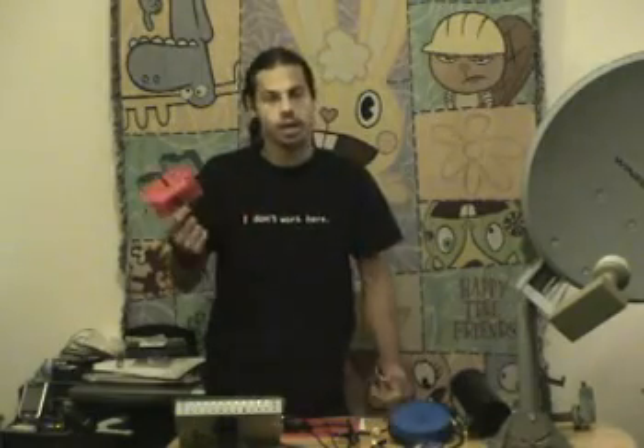When you're done it will look something like this — you'll have a metal reflective surface on one side; the side does not matter. You just stick your little rubber duck from your USB Wi-Fi adapter through it. This does actually work — I have them on my home routers. The problem is they're flimsy and destroyed really easily. Not too many people can fit a 14 to 18-inch satellite dish in their luggage on vacation, though I know I bring one. So this Windsurfer is the basis of a portable parabola solution.